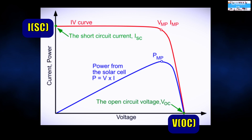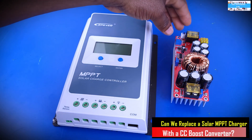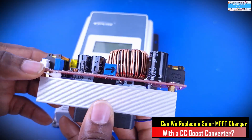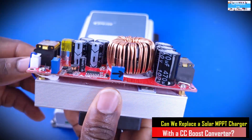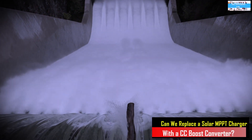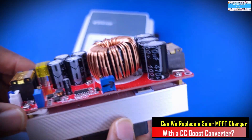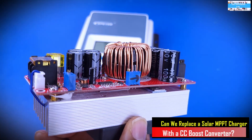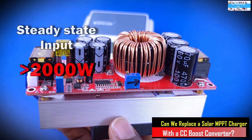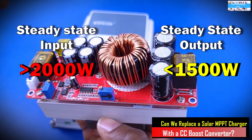The MPPT controller looks at the IV curve of the power coming out of your solar panel and figures out how to dial down the current without pulling down the entire panel. Comparing that with the DC-to-DC boost converter: this device is truly designed to function properly when you have a huge reservoir of steady power going into it. When you do not have that, it's not going to function efficiently. It is not designed for solar charging.